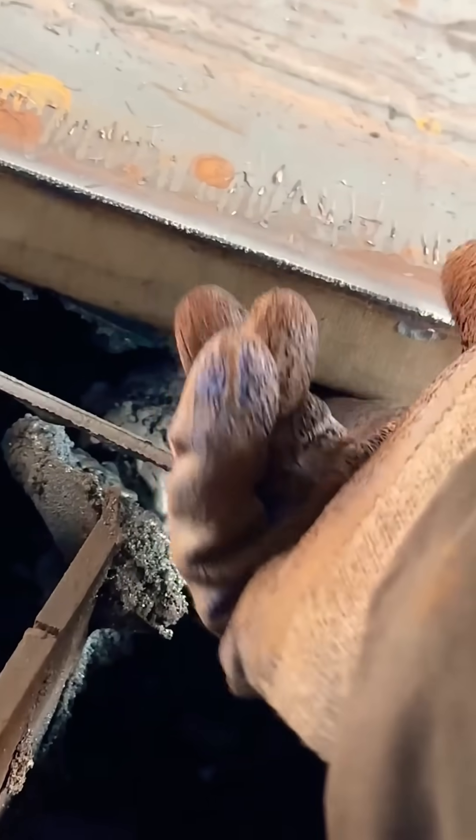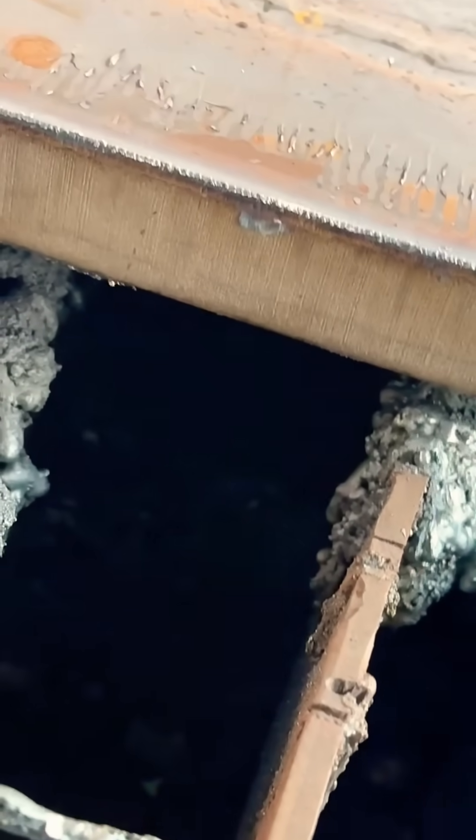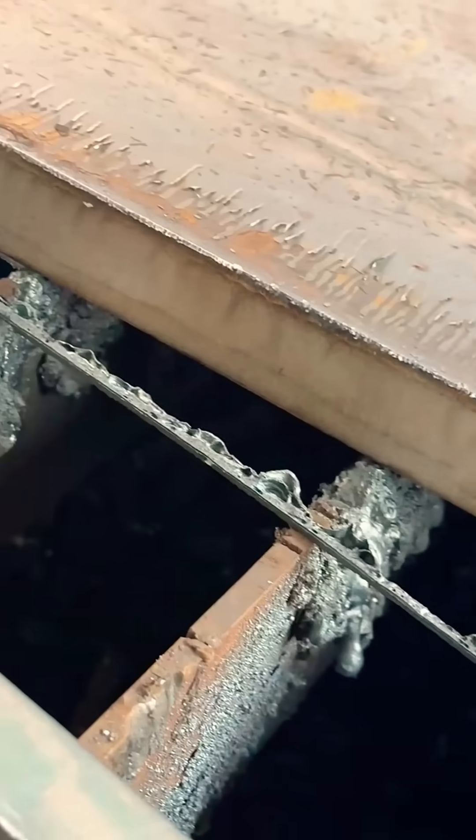Let's start. Brothers, look at this cutting surface. It's got a little slag that fell and stuck there, but overall it's very clean. That's the white face. Perfect. This is exactly what you get with a neutral flame — smooth, white surfaces.